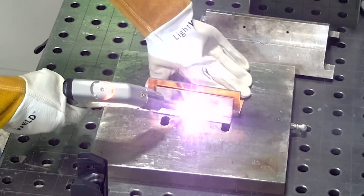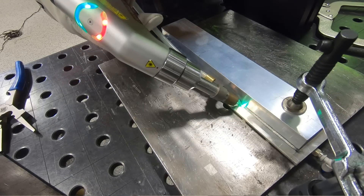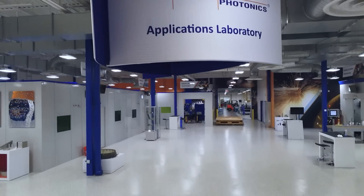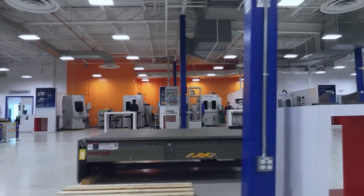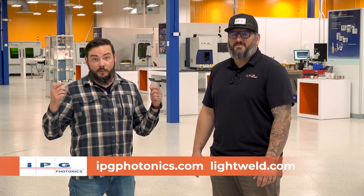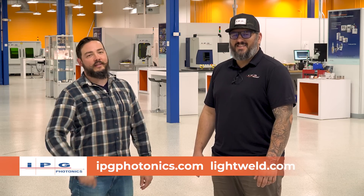So what do you think about the aluminum welding process with the LightWeld? Honestly, I didn't even really know you could weld aluminum with a laser like that before today. I'm impressed. This is a game changer for certain industries — as long as their mind is open to accepting a new process like this. You've got less heat input, it's faster, you get a nice skinny little bead that's strong, and there is really no downside that I see. We're very proud to have such a product that our customers really like. If you want to learn more about the LightWeld system, visit IPGPhotonics.com. Leave some comments below, and if you haven't downloaded the weld app yet, get to it. Till next time — hope this helps.